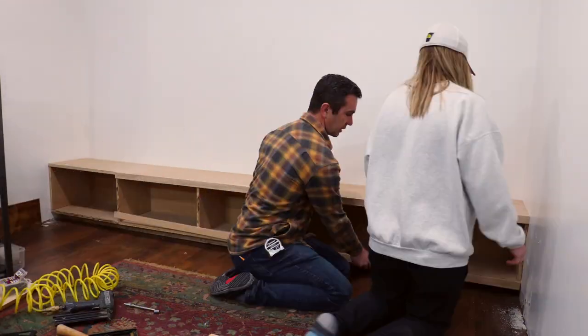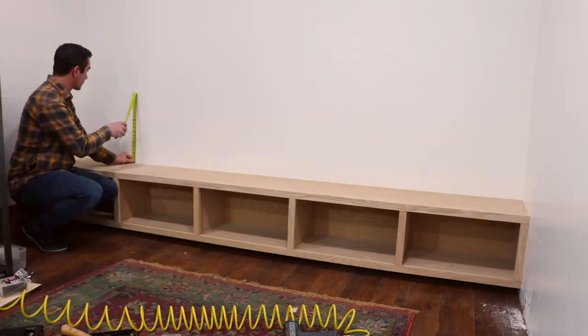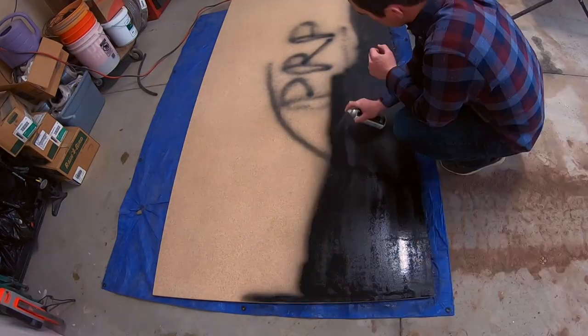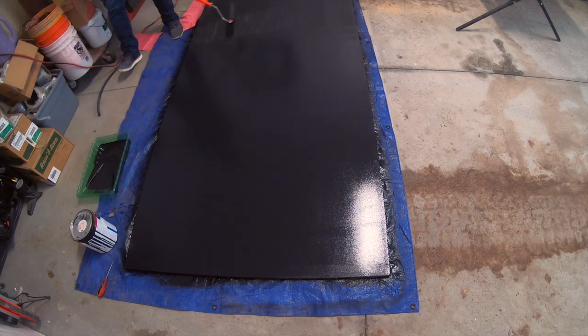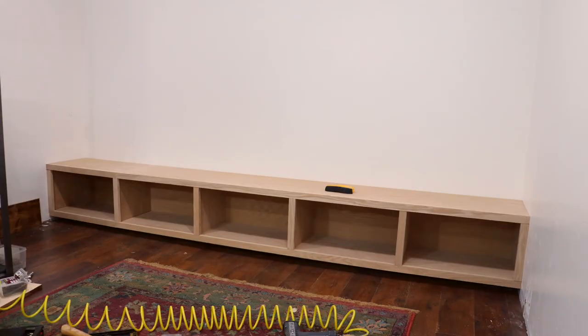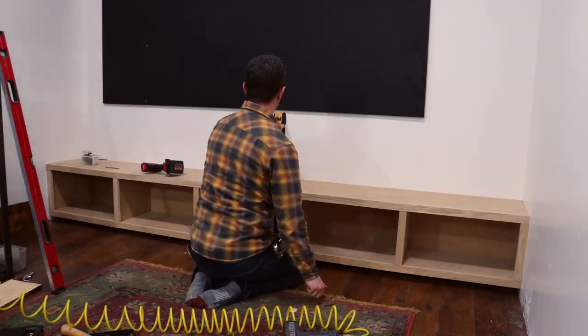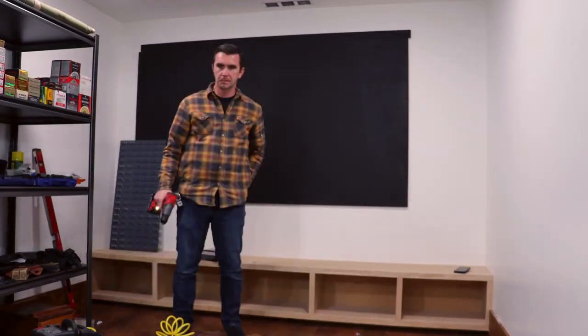The next thing was that these panels are a little over 17 inches — 17 and a quarter — so you can't just put them up and drill them straight into two by fours. What I did is I got some cheaper plywood, just particle board that was glued together, went outside, and spray painted the whole thing black. Spray paint didn't work, so I ended up having to roll it with some extra black paint. I've seen a lot of videos — some people stain it, I did black. I think black works the best, but you guys can decide for yourself. I painted the whole thing black in three-quarter inch plywood so it would be pretty durable. Then I had to get the measurements of my specific setup, put the plywood on the wall, screwed it into each of the individual studs, and then began hanging the panels.